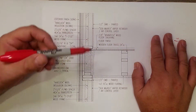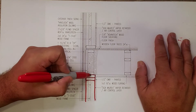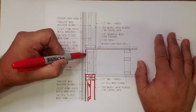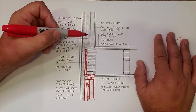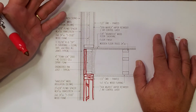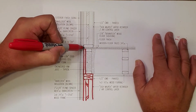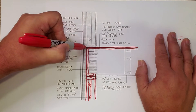Alright, so you can see here, this is the top of our first floor wall. It comes up, and there's our top plate — double top plate — and you can see here we have our T-stud happening below. That comes up into our floor frame, which looks very similar to the first floor frame. That's not atypical for construction. We pretty much keep things going in the same direction when we can, keep them the same sizes, same assembly type. There's some security and low risk in repetitive assemblies. There's our 7⅛-inch floor assembly by Advantech.